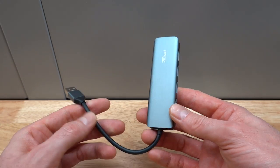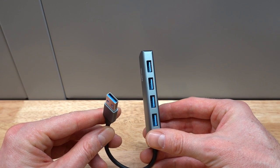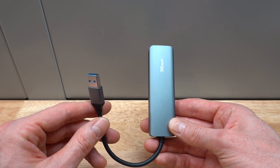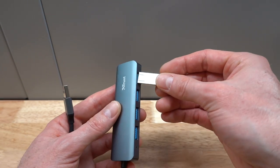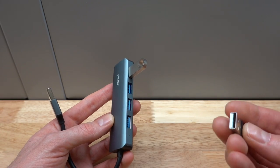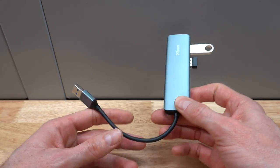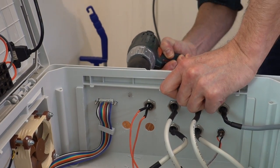I thought it might be possible to connect the USB hub, and sure enough, when researching this online, it turned out that people had already done this successfully. The DDCS Facebook group is a great resource for information on controllers from this brand. I bought a cheap USB hub and attached it to the front panel using some Velcro and double-sided tape, so it can be easily removed if needed. You can actually use a wireless USB keyboard as well.